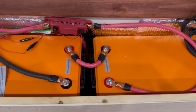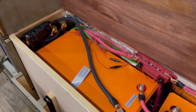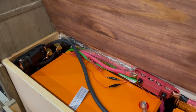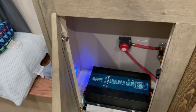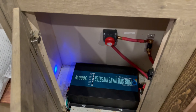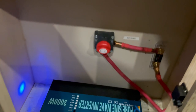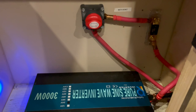We have two AWG cables and it doesn't get warm at all, not even to the touch. Everything is on bus bars. The shunt is down in here, and the green cable coming from the charge controllers - there are two of them - runs in here to the bus bar on both the positive and negative sides. You can hear it kicking in and out while it's running the air conditioner. It's a 3000-watt pure sine wave inverter. There's a big fuse and a master disconnect in there. It does get pretty warm in that cabinet when running, so we have to keep it vented.